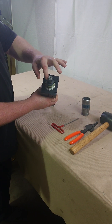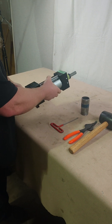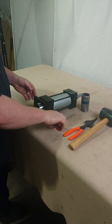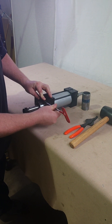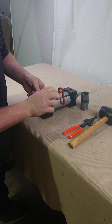We want to be very careful when we drive the spindle out that we're not damaging these splines — it's a very snug fit in there. The first thing you'll need to do is take your 3/16 Allen wrench and loosen the stop collar nut right here. If this is tight, it's going to put pressure on the bearing and make it much more difficult to drive out than it needs to be.